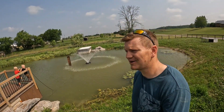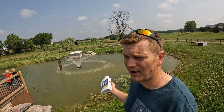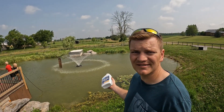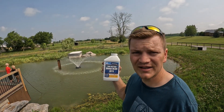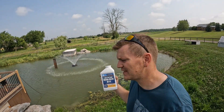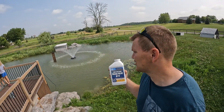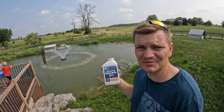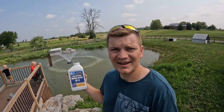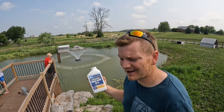The fountain's going and it looks awesome. The water is a little greenish-brown — we've got some algae in it, and we did suck a bunch in from the creek. So I'm going to put a little pond dye in. It's going to turn it blue, which will limit the amount of algae that can grow in it by limiting the light that gets into it, and it's just going to make the pond look ten times better. Now that the pump is going, it'll circulate the water enough to spread the dye around.